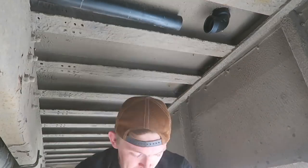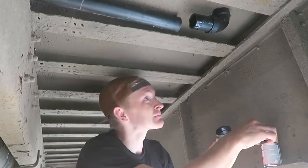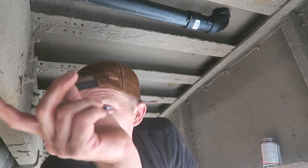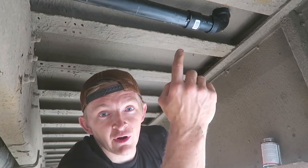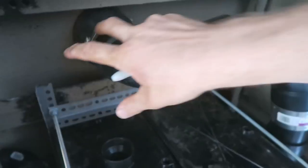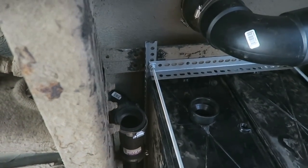And now the toilet is plumbed. Well, it's plumbed to the tanks. Now the sink is plumbed to the shower drain. All I need to do now is the elbow that goes from the sink and shower drain, U-turn into the gray water tank. I'm putting two rubber guys in, this one and this one, so I can remove this, and then I can plumb the toilet and the gray water together and have that both go to the septic system if we didn't want to run on tanks for long-term park situations.